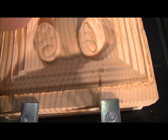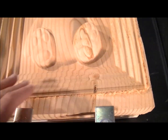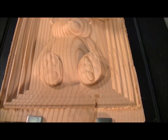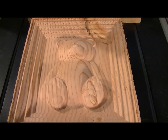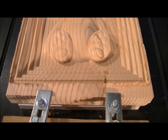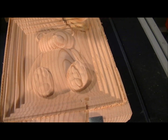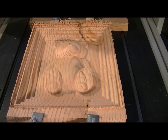That's a coarse cut there, with a bit of fraying here and there, but all in all it's not too bad. Now I've got the 3mm ball nose in and I'm going to be turning the feed rate down a bit. This is an XY pass, so it's going to take two cuts — first in the X-axis, then in the Y-axis. I'm expecting it to take about four hours, so we'll see how it goes.